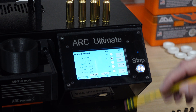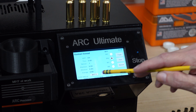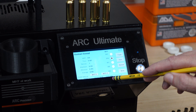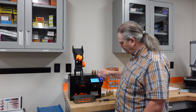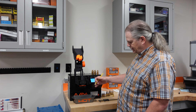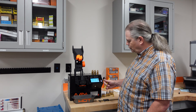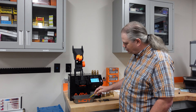I'm going to adjust the temperature right here in the normal anneal screen. Turn off auto and use the button at the bottom that goes five degrees hotter or colder. These were at 320, so I'm going to go up to 330 — hitting plus five twice. Then I'll set it back to auto mode and drop in my next shell. It will automatically start the anneal and when done it'll drop out so I can examine the color line again and determine if another change is needed.